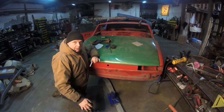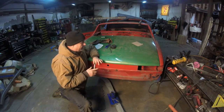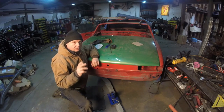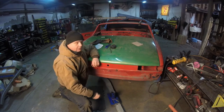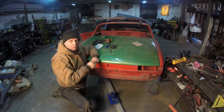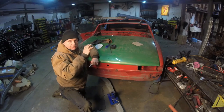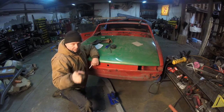Now we're at the back of the car. We're going to start here, and then I'm going to put the front on. What we have is the center line of the car. It's not the center of gravity, it's the center line of the car. So we have equidistant top to bottom, so when we turn it, this side and this side will be equal, so we know exactly and make sure it has ground clearance from the rotisserie.